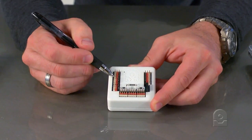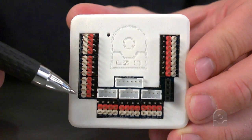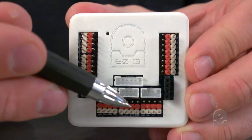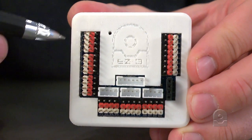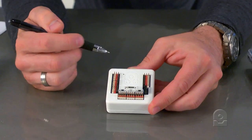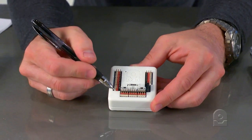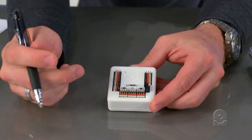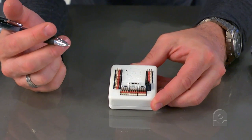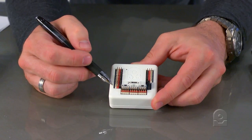These ports here are digital ports, as well as down here. They're used for powering servos, pulse width modulation, turning on and off LEDs, etc. The power pins on these digital ports are not voltage regulated. That means the number of volts you provide to the EZB will also come out of these ports. The robots are powered with 7.4 volt lithium polymer batteries, which means our servos are made for 7.4 volts.